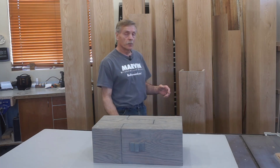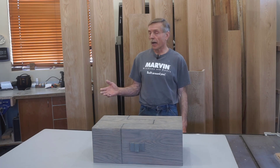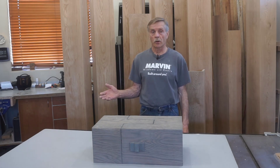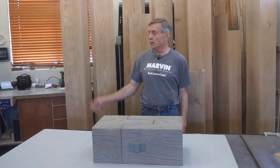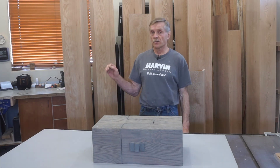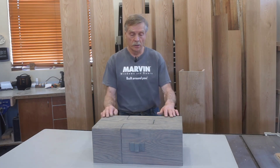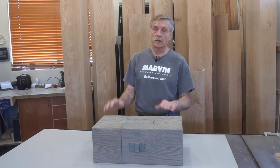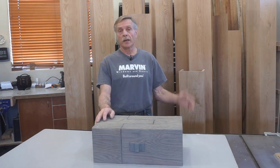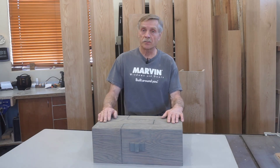The last given for a project like this to get professional results is to have accurate and sharp equipment to work with — a sharp table saw blade and the ability to accurately set angles, same thing with the jointer; the knives need to be sharp and not nicked, the fence needs to be true, and all that setup needs to be reliable so that you can focus on getting a good end result and not fussing with equipment. So with all that as a background, I'm going to get into the five secrets for building the best box beams.